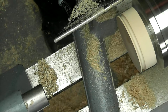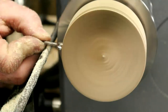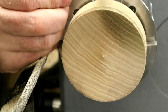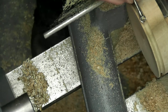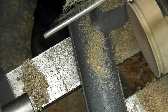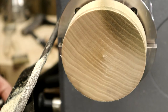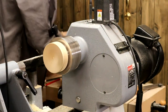Just need to check now how wide I am, because the ball cutter we're going to use in here has got to fit into that slot. Okay, very difficult to show on there, but you've got the ball on there now. Let's just have a reach and see what I can do up here for you. So the ball cutter's got to fit into there. Okay, too much. No, you can just see it on the corner of your vision. Look, I'll bring it back over. Got to fit into there. Now, at the moment, that fits too tight. It's not going to go around. So if I run the wrist, if I start trying to push it in, it's going to catch the tailstock end of that blank. It's got to be able to spin to go into that groove. All right, so I want to bring it just open, just a little bit more. Okay, get off there, open it up. Change cutters.